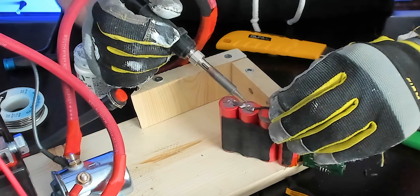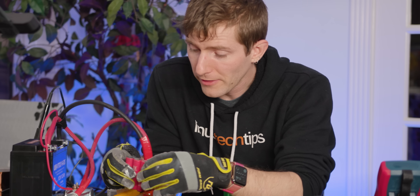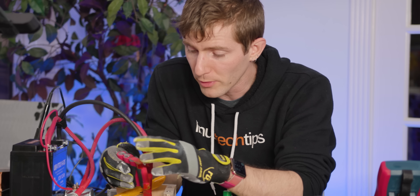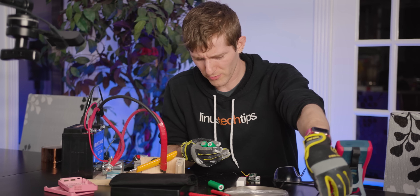These old cells were a little less worrying to damage with heat because they're kind of dead already anyway. So we're just going to de-solder them real quick. You can see here I'm going to have to do a total of four plus four spot welds with three strips — a strip here, strip here, strip here, strip here. Here's where it gets real. Wish me luck.